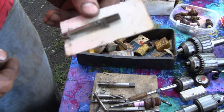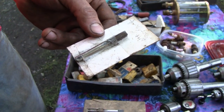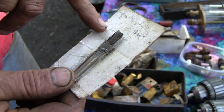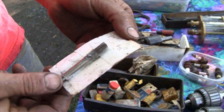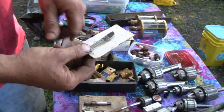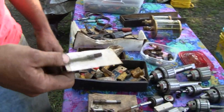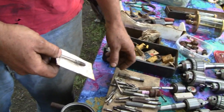We just came across something really strange that I've never come across. This is the addendum to the tap identification — this is a left-hand tap. On occasion you need to do reverse threads for something that would unscrew if you don't want it to. You can get all these other tap types in left-hand as well — basically the teeth go the other way. I'll have to write it darker so I can remember that, because if you put this in the drawer with your other ones and try to use it, you're going to be a little confused for a while.